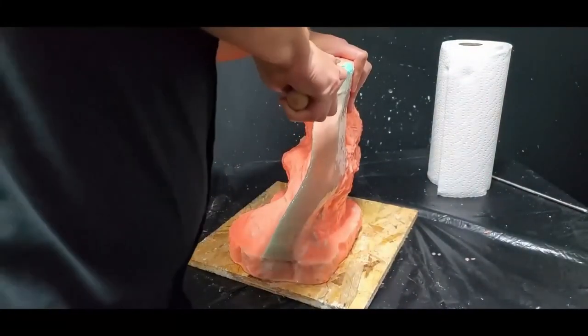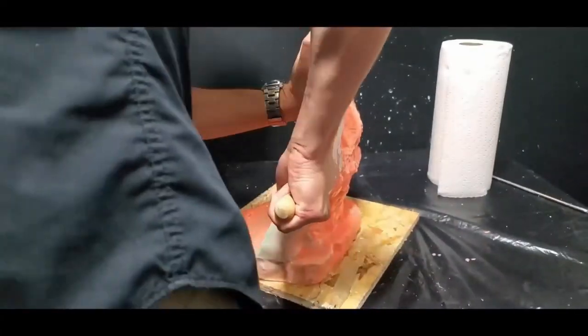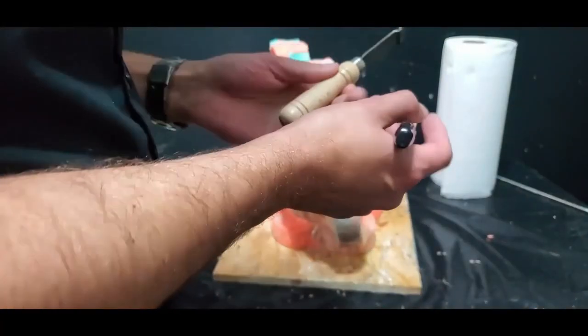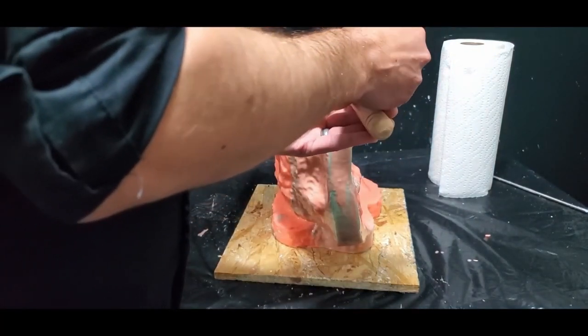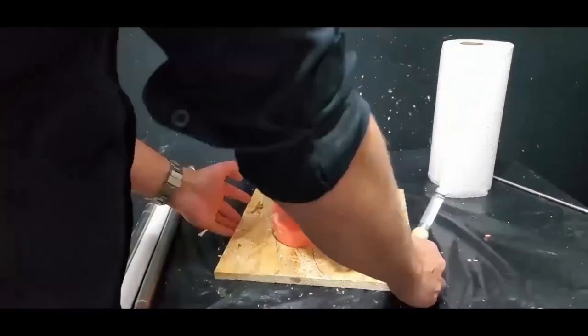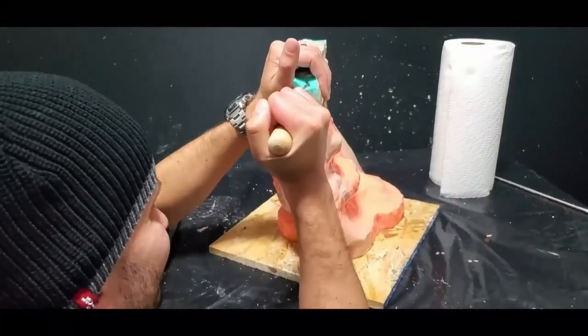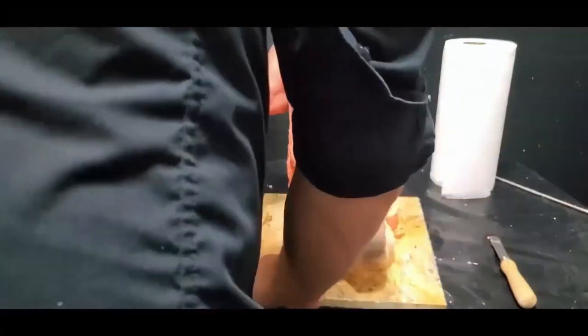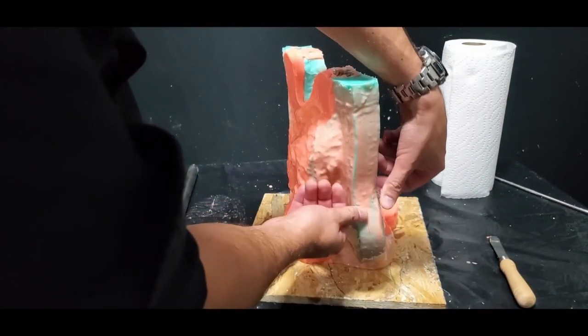Before the mother mold, I tried out the mold key knife — it took a lot of force to cut through the silicone rubber even though the blade is super sharp. For the other side, I marked the knife with Sharpie to better control the depth of the cut and keep it uniform. The second side went a little smoother, but was still difficult. The mold key knife did a really great job of making a clean cut that sealed back up almost invisibly.